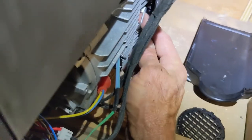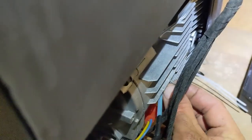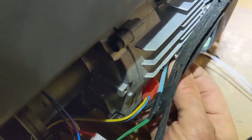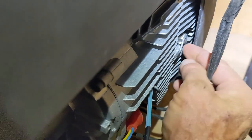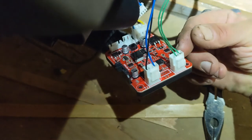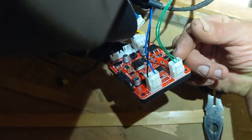The first thing I did was try to swap the temperature sensors. They're held in with a little clip — you pull this up, there's a little hole, you lever it out, and then the temperature sensor comes off. It's plugged into the board right here. I swapped the temperature probes and that did nothing.